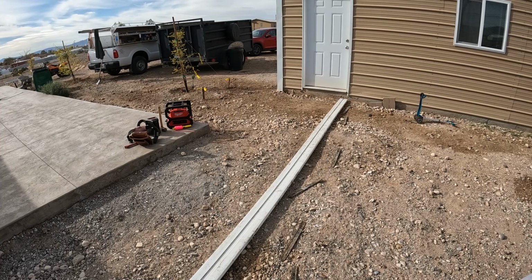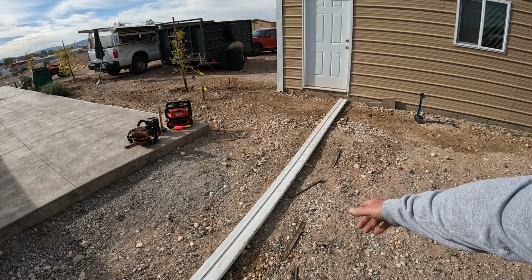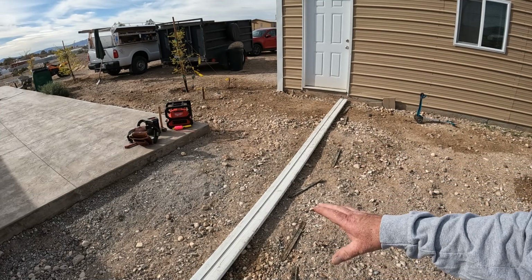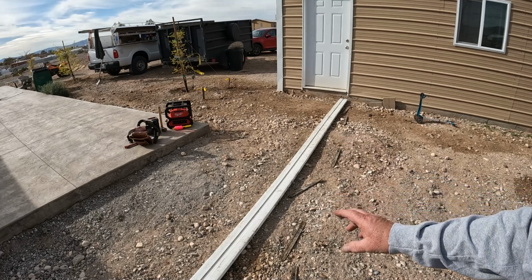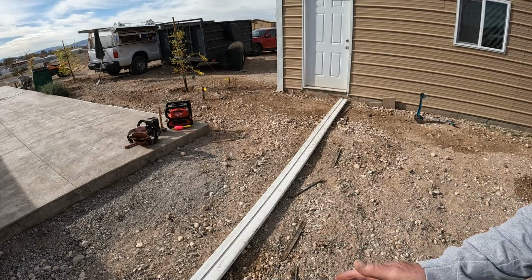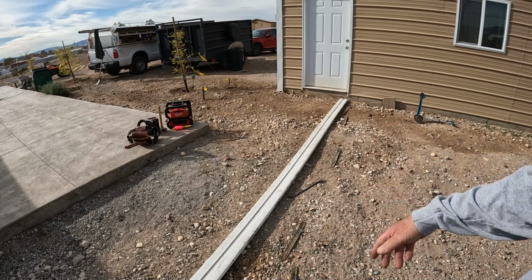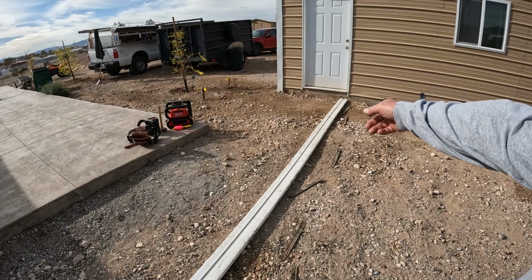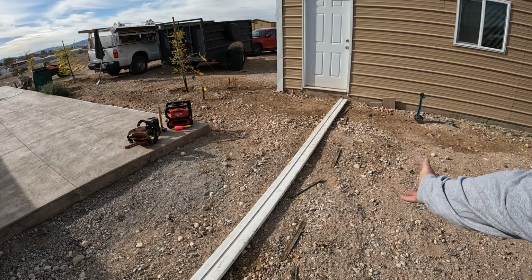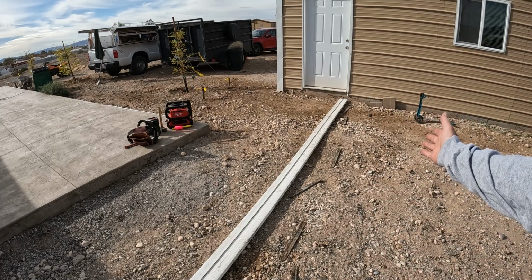So what I'm gonna be using here is the 2x6 plastic from Proline. I don't really care for it, however, because it's actually a true 6-inch. It'd be better if it was really 5.5 to marry it with real wood, but it's gonna work for this. So you can see the depth I've got. It's pretty high, so I'm gonna use 2x6. I can get away with a 4-inch slab here, no problem, but we're gonna set it up with 6.